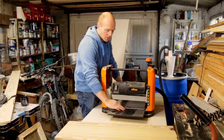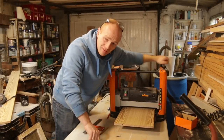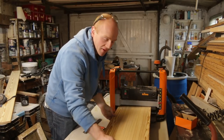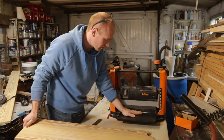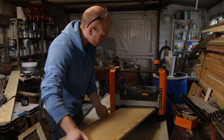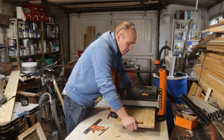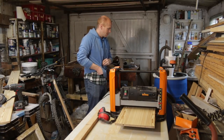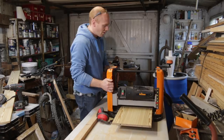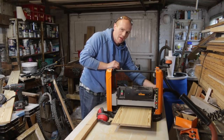My thinking is that I'm going to extend the rather short infeed/outfeed bed of the planer with a board. I've spent a long time fiddling with the infeed and outfeed table to get them as flat as possible, and then I've made this from a flat board — there's a little ledge either side which slots over both pieces to stop it moving. This will also give us a chance to test out our new dust extraction system with a cyclone, although it isn't properly rigged up to the exhaust because it's not quite big enough, but it should get rid of most of it.